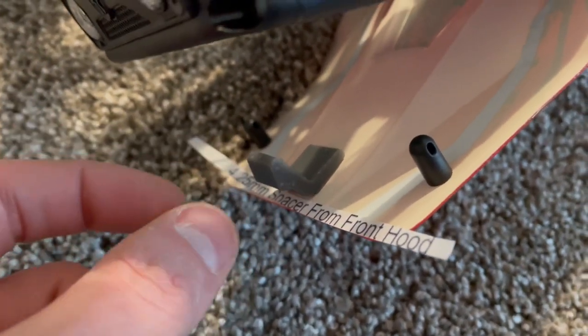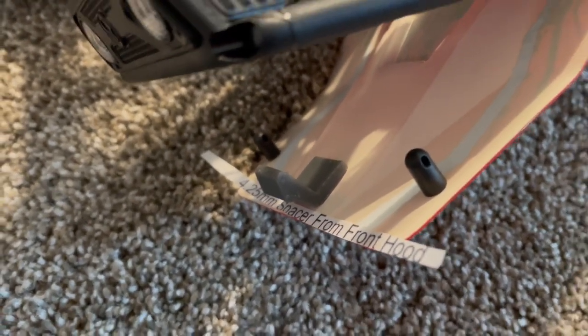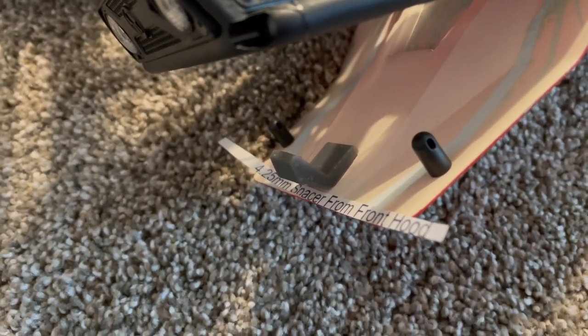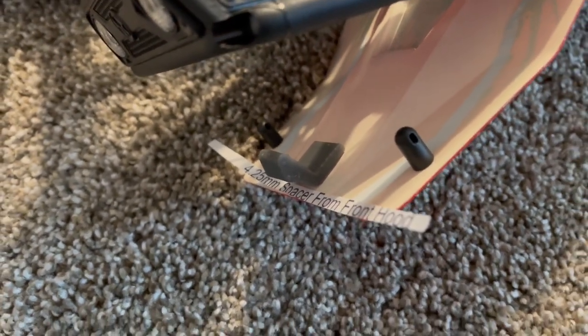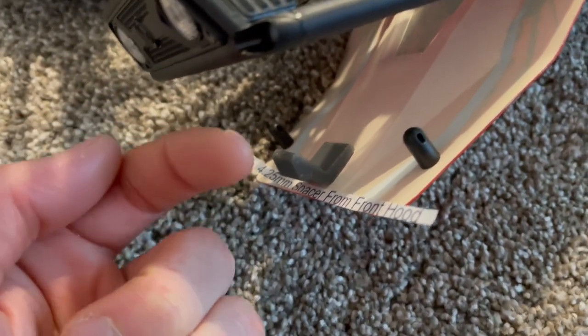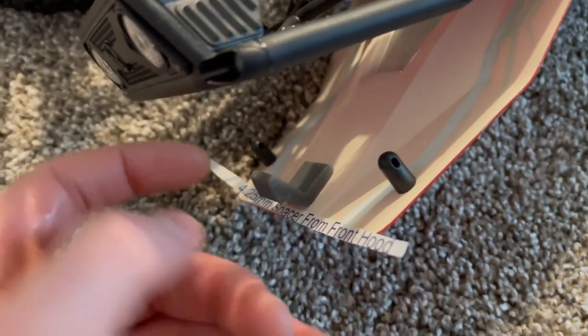I have mine at about 4.25 because I think that's the sweet spot where it's just stiff enough but it's also relatively easy for me to pop it up. And my battery also isn't going to be pushing against this latch so I don't really need it to be that secure. Now if you have a situation where your battery is going to be pushing against this and it's going to be a little bit stiffer, then you might want to pull it a little bit farther forward towards about four millimeters or maybe 3.75. It might be a little tight, but you can always pull it a little bit forward and adjust it.